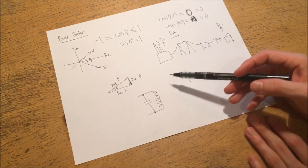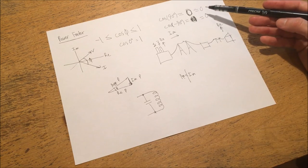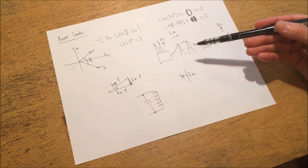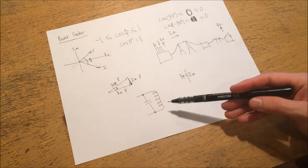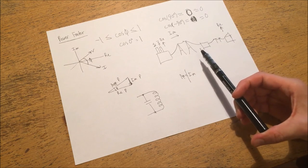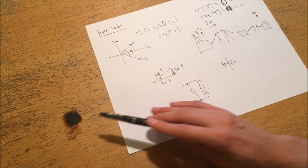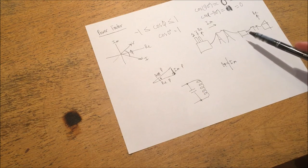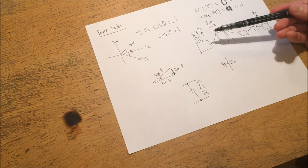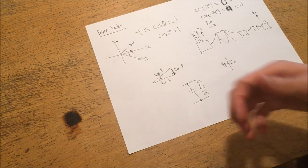Hopefully you've learned something in this video, and hopefully I haven't made any other mistakes besides my cosine blunder. This is effectively how power factor works, and it's important because you want to minimize the unnecessary load you place on the infrastructure. As you saw, bad power factor does create real problems — as you can see from the burn mark here. Power factor correction is a critical application and a good idea to know about. Thanks for watching Dielectric Videos — I'll see you next time.